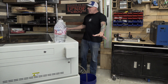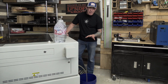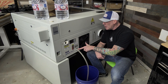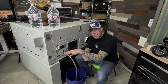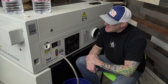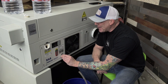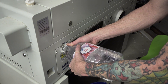Depending on how long it's been since you've changed your chiller water, or if your water is extremely dirty, you might want to flush and repeat that process three to four times. If you notice your water was really dirty, you can leave your hose attached and just start pouring some fresh water into the water inlet — that will loosen up remaining dirty water and get it down into the bucket. We recently changed our water so this is looking really clean.